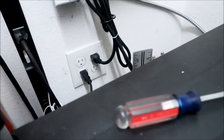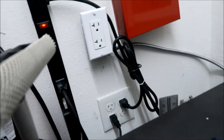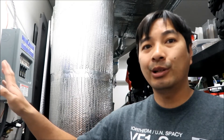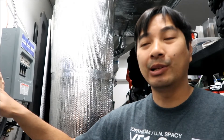I plugged the power strip back into the garage outlet. This one is the inverter - I went from there to here and now the refrigerator and everything has power again. That's a bummer that it just died on me. One thing I can do is set the low voltage cutoff for the inverter to something higher so this doesn't happen again, because we have that one bad cell.